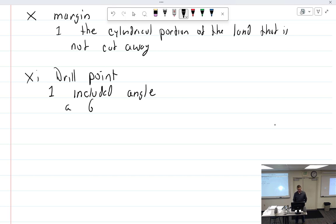All right, general purpose is, according to that, 118 degrees. That is how much on each side? 59 degrees each side. So that brings into this little gadget here. I like these better. So if you've ever seen these, that is four drill bits. And it says right on there, 59 degrees. And you slide it up on here, and you'll see that that is, in fact, 59 degrees. And that side is 59 degrees. And that makes it a total of 118.